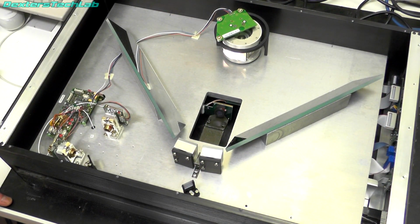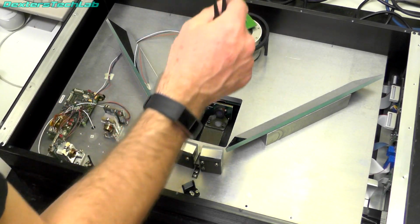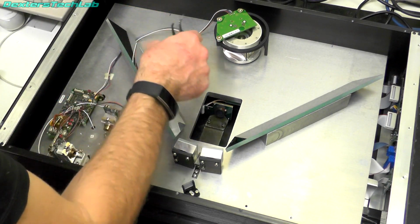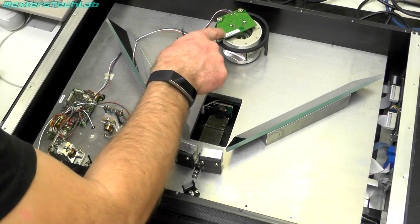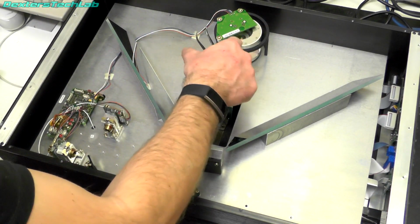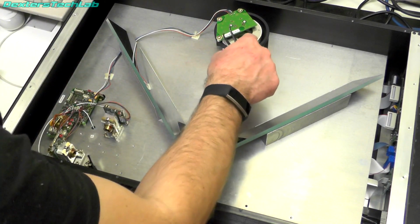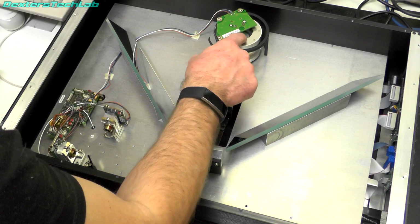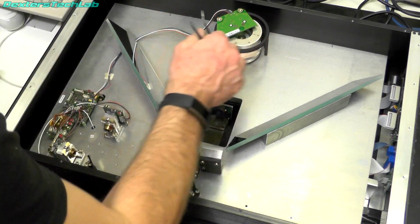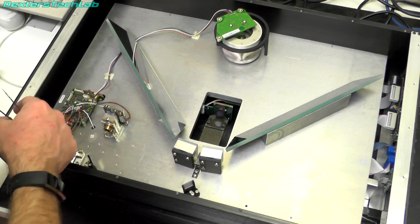So now we can see the optical side. We have the rotating mirror just there. Interestingly, there is actually, oh, I see. The other connection on the other side is for the motor, and then this is some kind of sensor assembly. It looks like there's notches in an encoder wheel which is attached to the top of it, so it's obviously monitoring the rotational position of the mirror.